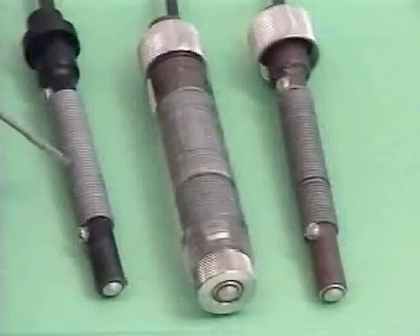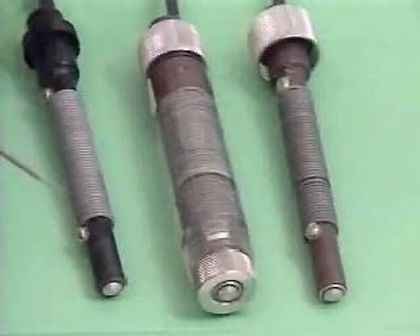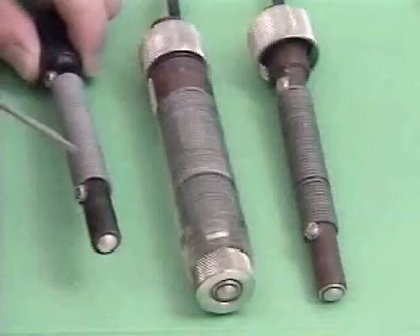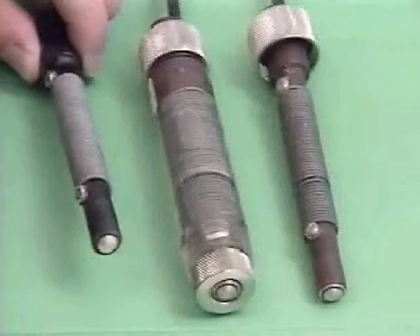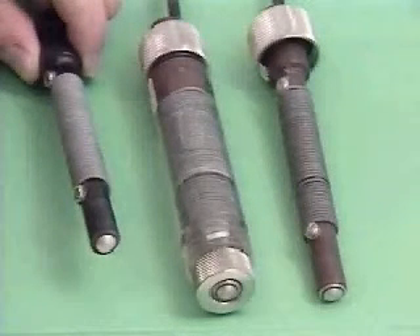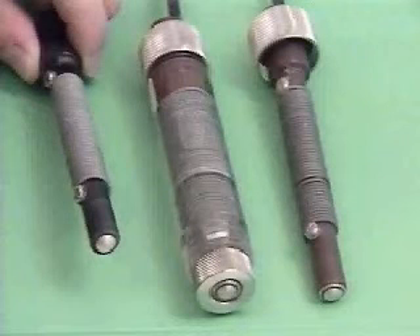This is the interior of the Model 95 sensor. It differs in that it has only one platinum cathode and one lead anode. This sensor is not intended for use in electrochemical self-cleaning applications or low-level parts-per-billion dissolved oxygen measurements.